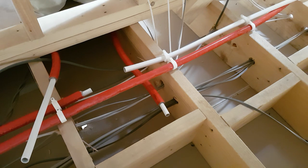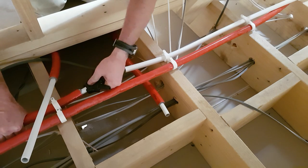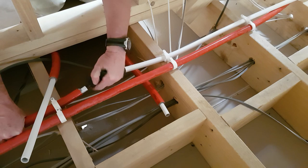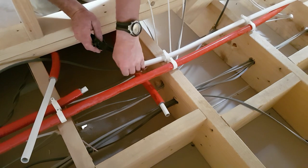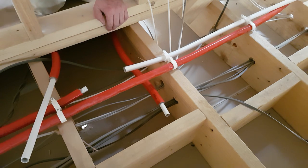I'm in an awkward spot here, I'm not sure what you can see or even what you can hear. I've prepared this pipe. I've used my reamer inside here. These fittings can be quite awkward. With push fits, you can just push it on and you're kind of halfway there. These fittings are more reliable because they rely on the inside of the pipe, which generally isn't scored on sites. The outside of the pipe, if you rely on O-rings there, can be torn and won't make a great seal.